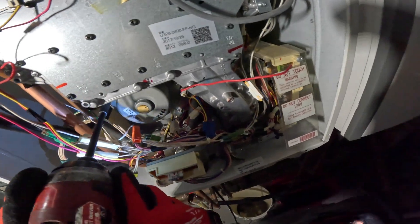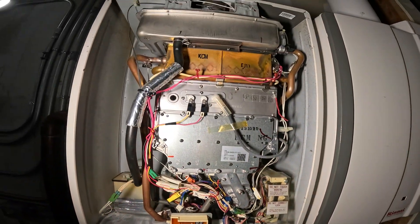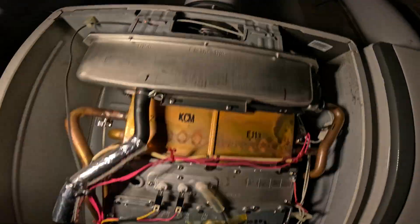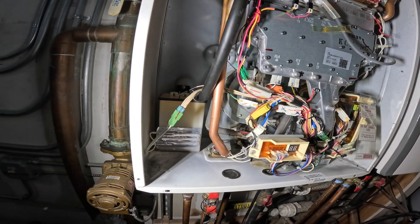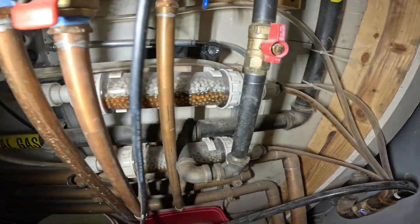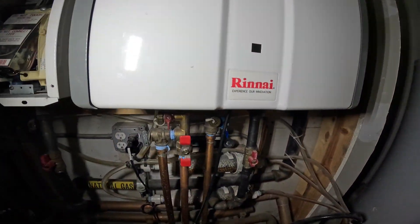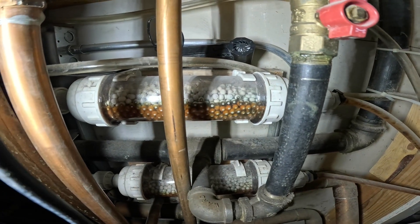Lock that up. We'll put all of this back and let this thing run. Customer wanted something quick, so this is something quick. The dirt we took off the top should help a lot. This area is pretty decent — clean out all the dust from here, and the fan motor blade is good. Clearly the machine was running so the fan motor runs. The last thing we could try is to blow out the drain and make sure it's okay. If the problem persists, we're going to have to blow out this whole line, clean out the whole air intake, and change the condensate neutralizer.